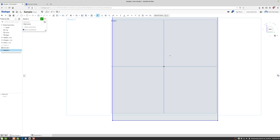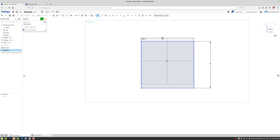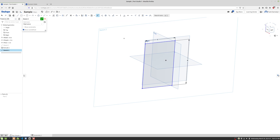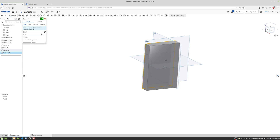Our leg is going to be six inches high, the same as our width — and actually the top shouldn't have been width, it should have been height. We'll go ahead and enter. So that'll be just fine for our leg. Then we're gonna go ahead and click the green check and extrude 0.75 inches, and click the green check.